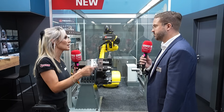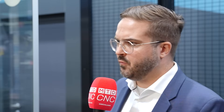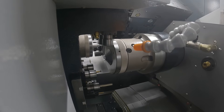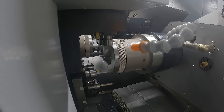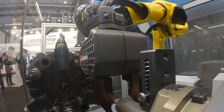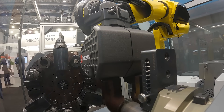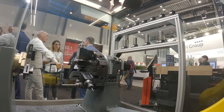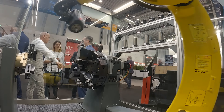What is it that people are doing on a day-to-day basis with tool changing — what's the reality of it? If you don't have any quick change system in the turrets, you might be spending around five minutes per tool to change the holder, then redialing it — maybe that takes around 20 minutes per change. That's a lot of time lost because the machine is not producing. With quick change technologies you're able to do that in mere seconds, a fraction of the time.